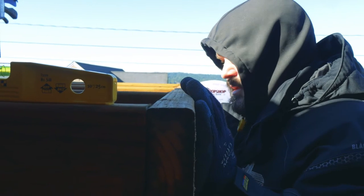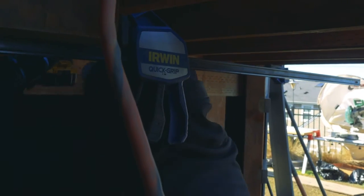As long as the two-by-six is tied up against the bottom of the joist, let's lock it in — do one on the right, one on the left before you start doing everything. Then we'll double up the ends and do high-low, like boom boom. Go a little closer to the edge. There you go. I don't know if you need a hammer or you're good — there you go.